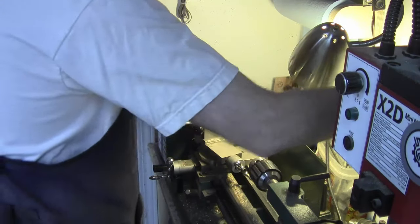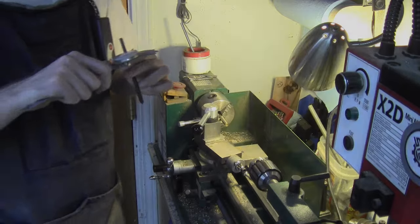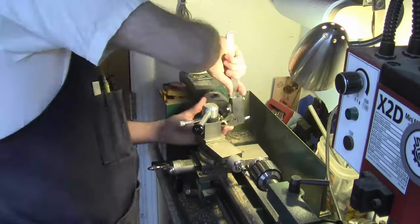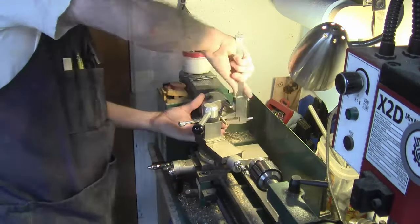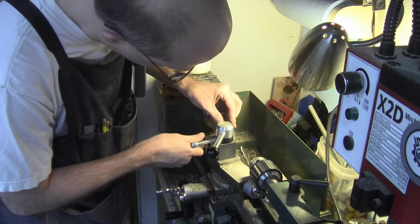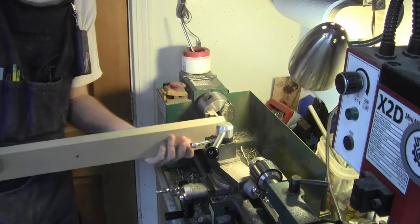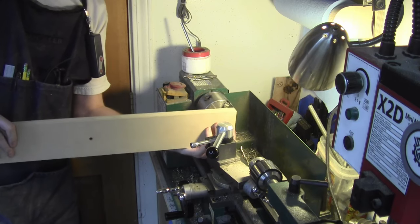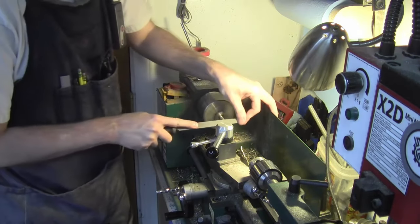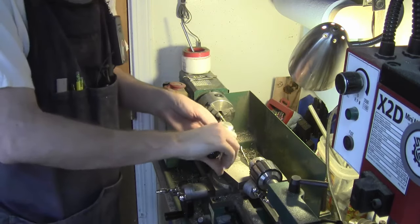So we're going to use this as our target diameter, which is 262, it looks like. Just a teeny bit smaller than our 262-ish. Yeah, so that probably will press in. I think I can get it to start right there. So I'm going to call that good. And now we'll chamfer it in while I have it here to help it start.